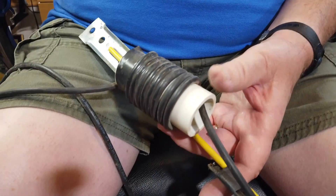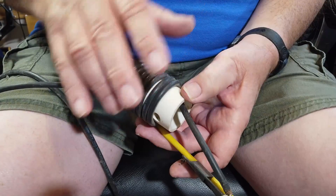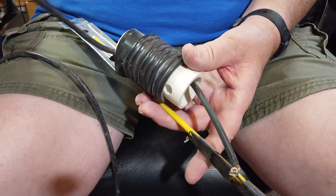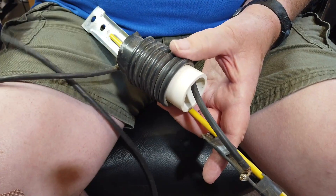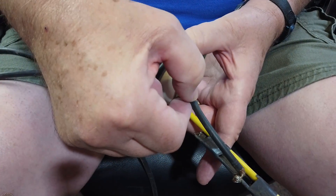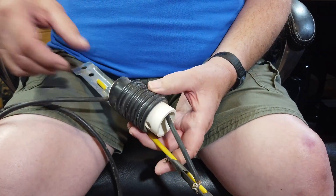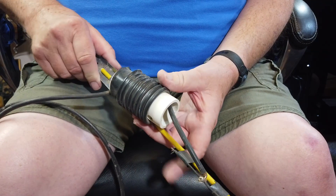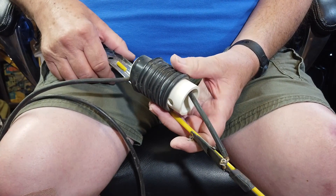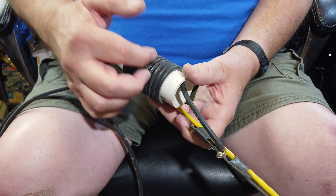This is fine — it won't produce as much inductance as something at HF. But when you're dealing at VHF, a little bit of inductance goes a long way. All this does — this is not a transformer — is use inductance in this coil to impede the flow of RF so that it doesn't come back down and get into the radio. It seemed to work fine because I used this for quite a while until we sold the Polaris, and this antenna has been sitting in my garage ever since.